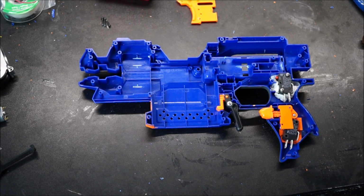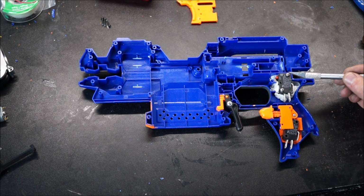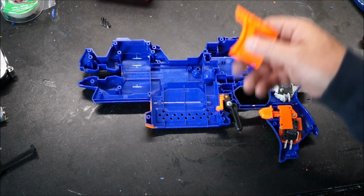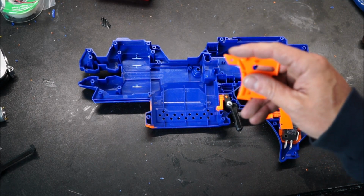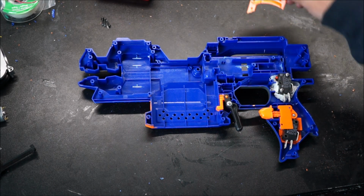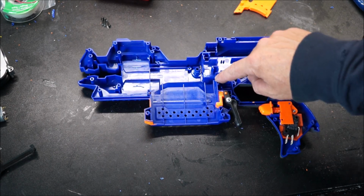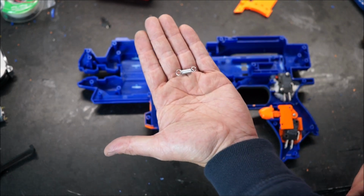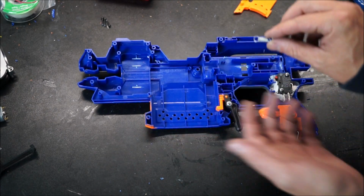Okay, so our epoxy putty set up. I've driven these two screws into the epoxy putty to hold the switch down. It's nice and firm. And you remember the hole that we drilled in the front of the trigger, up here where my finger's at. I also drilled one in the front of the body, right here, inside the magwell. So I've got this little extension spring that we're going to use to assist the trigger return.